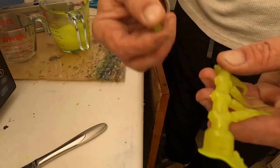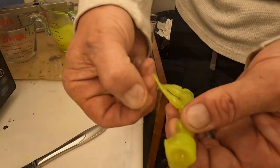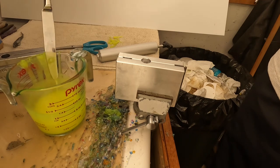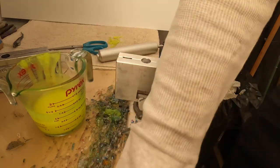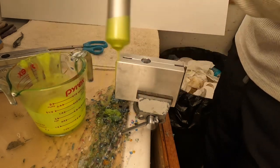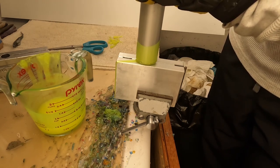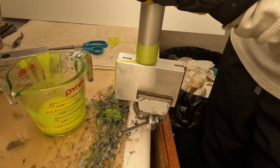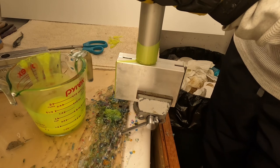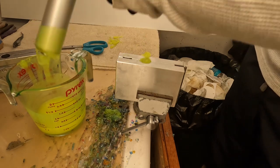We're going to shoot one more set of tails. I got all the sprues and everything melted down, going to shoot another round. Let's get some plastic in there, hold some constant pressure down — this is a very small mold so it doesn't take much plastic to fill it up. There we go, let's fill it a little bit and put the rest in the cup.